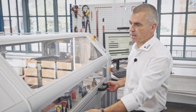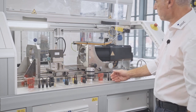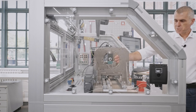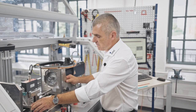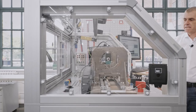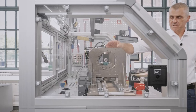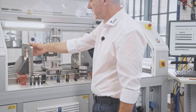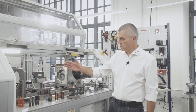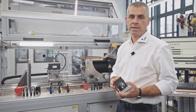Let's continue with the test room setup. The test room contains the electrical panels for the power connection of the motors. We have the test bed with a precisely aligned powertrain which is adjustable by a ball bearing slide. The powertrain itself can be adapted to various customer needs. In this setup we use an asynchronous motor for the load machine, a dual range torque sensor, and an adjustable test motor adapter. The modular design concept allows the use of sensors from other suppliers, and the alignment concept enables the user to change one torque sensor to another without re-alignment of the powertrain.